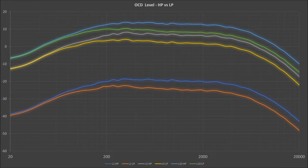Otherwise, if you turn up a lot of distortion with a completely flat frequency response going into a clean amplifier, or especially a dirty amplifier, then things can sound really shrill and ice picky on the high end and really fat and fuzzy and not pleasant on the low end. But you have this gentle roll off that's just ever so slightly mid-focus, sort of a first order filter of sorts. And it sounds flat to our ears. It sounds like nothing's really changed.